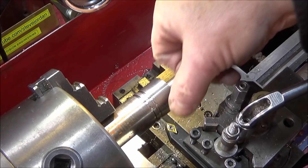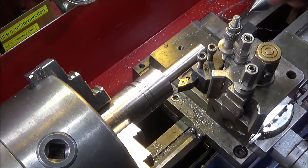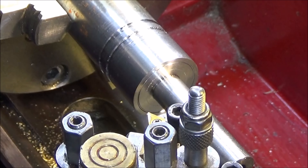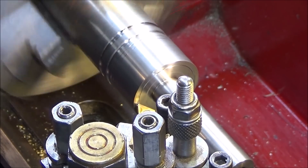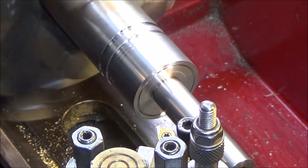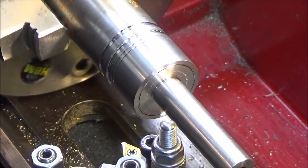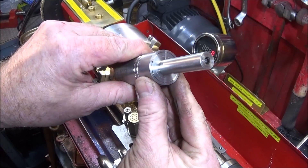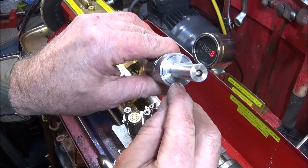You can see there that the inserts in this tool handle the stainless steel perfectly. I've now turned the tool round in the tool holder and put it on the other side to show that it can go into the face and do decorative grooves in that face. It's a great tool for marking faces or doing decorative grooves in the face.